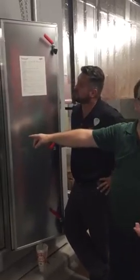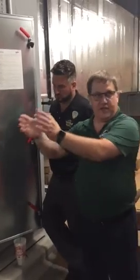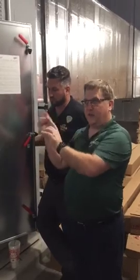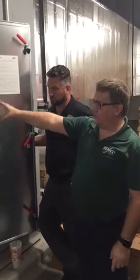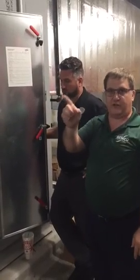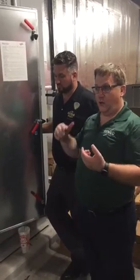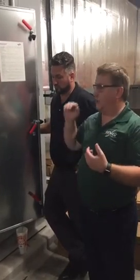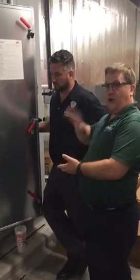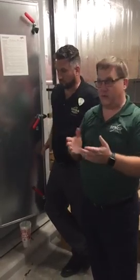You can see on the inside, on the center wall, the reason there's a center wall is you've got an outside air supply air path and a return air path, or what we call return air. It's actually the building exhaust path, side by side. So we have a recirc damper in the center wall, and what that is for is if the energy recovery wheel fails, say a belt breaks or something to that effect, or the building's out of control for some reason, that can be a fail-safe. You can open it up and turn it into a recirculation unit, the outside air is off the unit at that point, and you can provide dehumidification in that way.